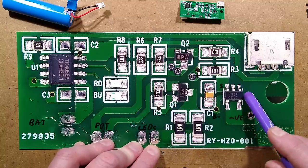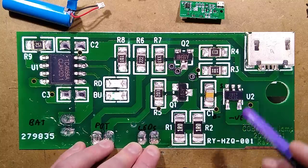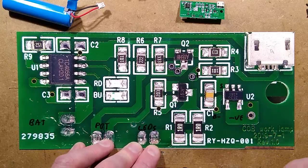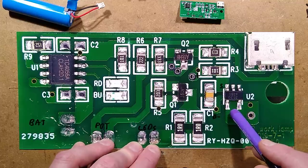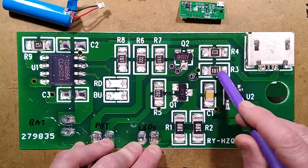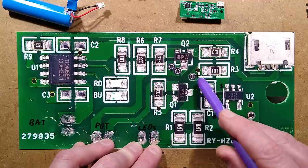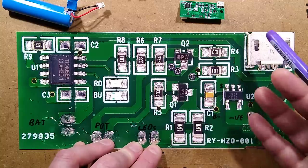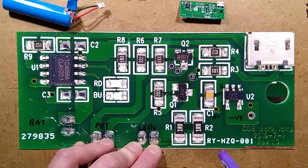One notable difference to some of the other circuits is this little chip here called a 3130, which is apparently an abbreviation for BRCL3130ME, and it's a protection chip for the battery. It's in series with the negative, and it's got this 100 ohm resistor here and a capacitor here just to provide a stabilized sense supply from the positive rail, and if it detects a voltage going too high, too low, or short circuit conditions, it will cut out. That's good.